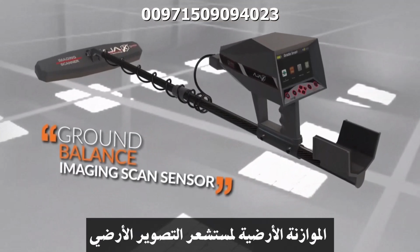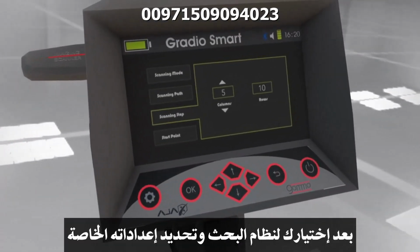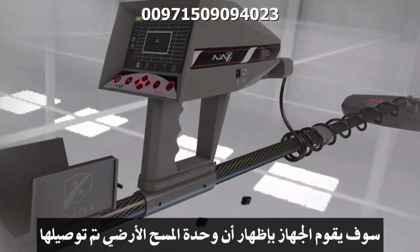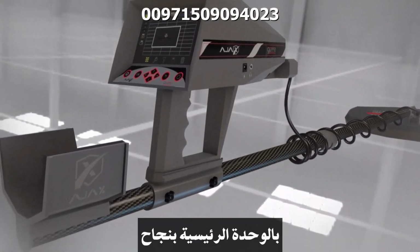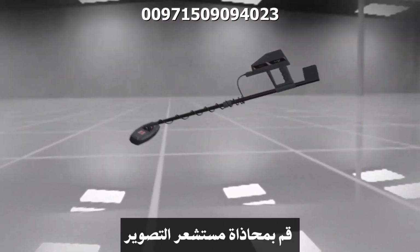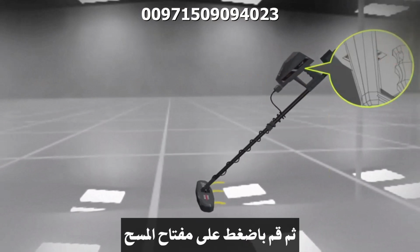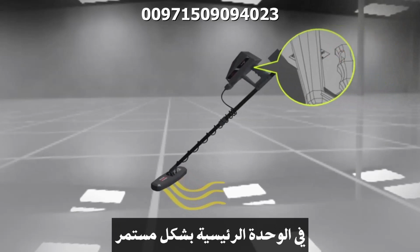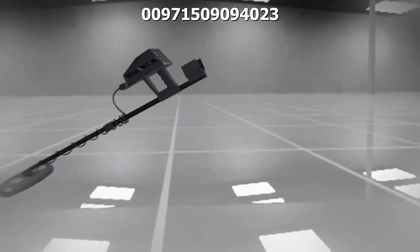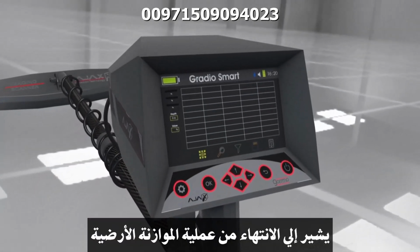Ground balancing the image scanner sensor. After selecting the scanning system and setting up the parameters, the device will prompt connecting the imaging scanner sensor with the main unit. Then the ground balance interface will show. Align the imaging sensor so it is parallel to the ground surface and press the grip key on the main unit constantly while moving over the scan area for 10 seconds. A chime will be heard indicating the completion of the ground balance process.